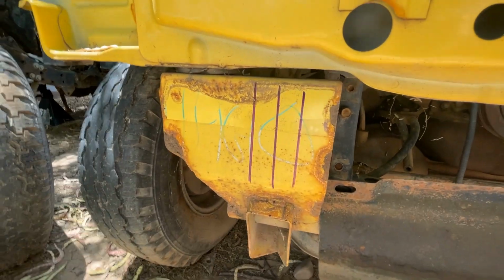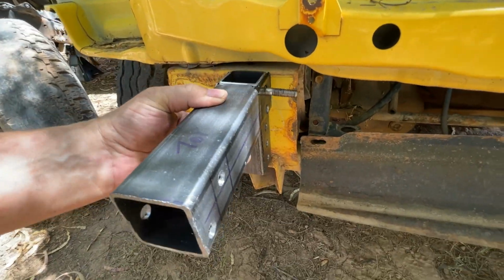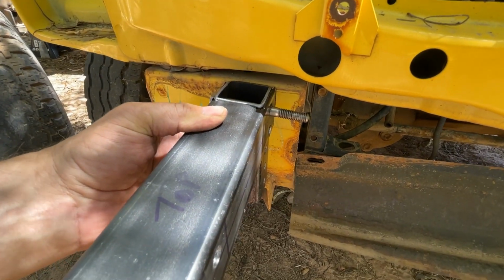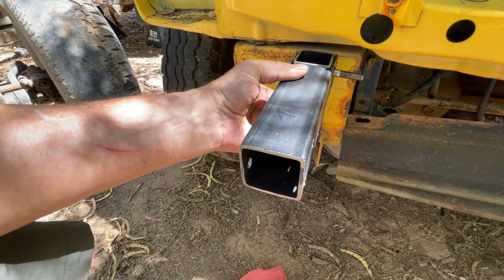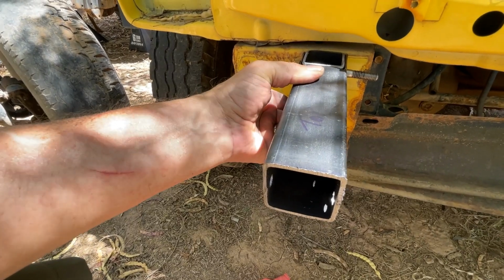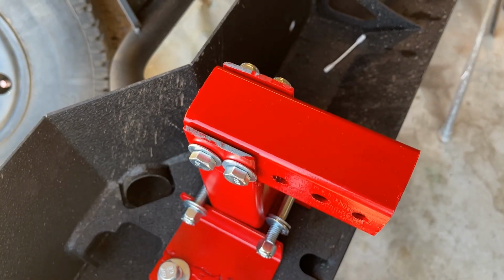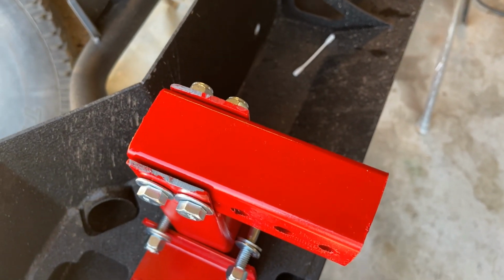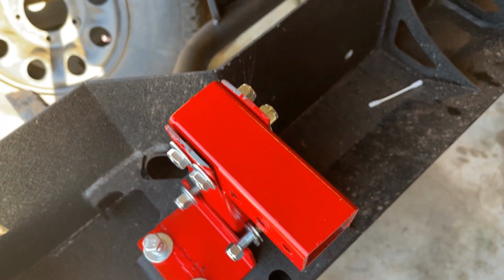All right, cool. Okay, so once you have your horn in position, and it's bolted on or ideally welded on, then you can put your extension on right here, this 8-inch piece that we have right here. And then this is going to hook to the angle iron that's going to hook to your bumper. That's how you're going to mount your bumper. This needs to be welded to the front of your Geo Tracker Suzuki Sidekick, your two-door model, okay? 29 inches on center. That's where it needs to be. You can't really deviate from that, okay?